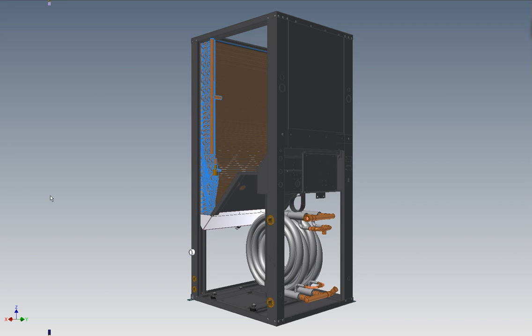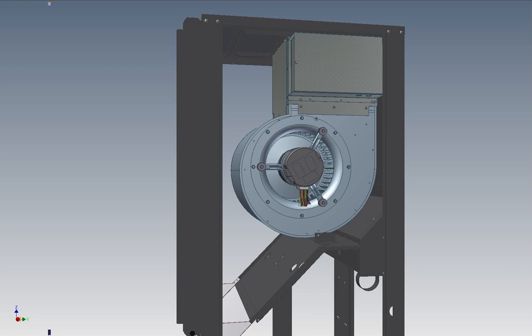There is a nozzle style distributor on this air coil for the best cooling mode performance, with a heating bypass check valve which is a feature not commonly found in geothermal units. The blower is a very important component to move air through the forced air system quietly and efficiently. Despite its small machine size, the blower is a full size blower, as opposed to the tight blower found in most competing geothermal units.